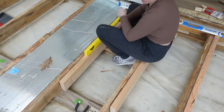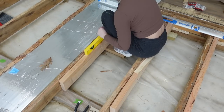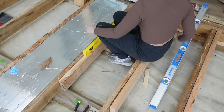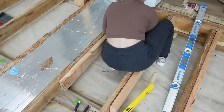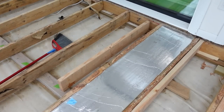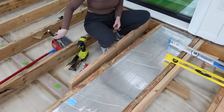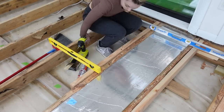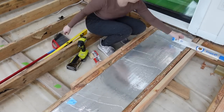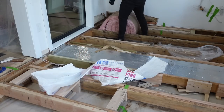By these vents, the floor was dipping considerably, and it's because it definitely wasn't supported properly at the wall. So I had to throw in some extra blocking underneath — you can't really see it because I went back and did it afterwards — just to make sure that extra board I added wasn't going to warp over time.